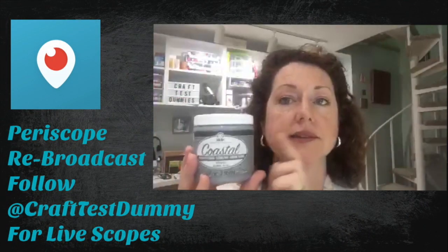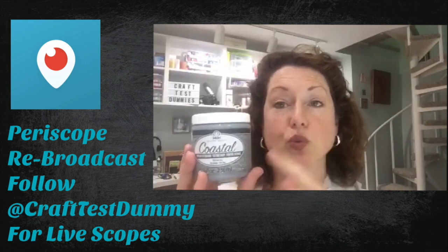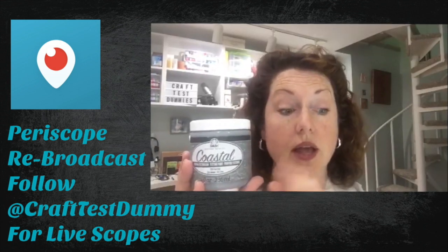It's a texturized paint — a really gritty gesso that's already tinted. It's an indoor/outdoor paint and it's a thick paste-like paint that's applied, layered, and distressed to create an authentic weathered-by-the-coast look. You apply it with a spatula or brush, create peaks using a tapping motion, dry for two hours, and then sand to the desired effect.